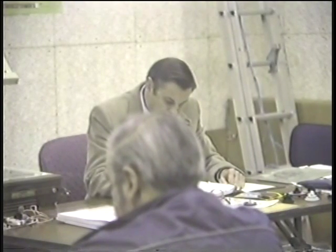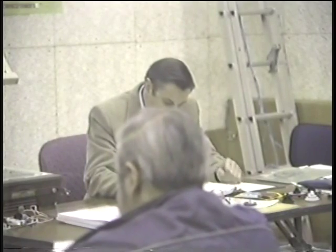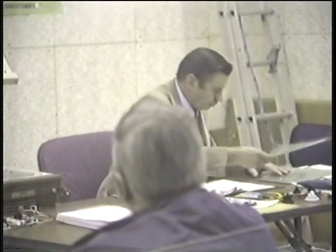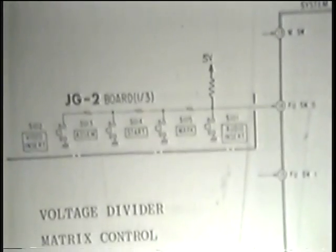Control of the edits is handled by IC 401, system control, main system control IC. The interesting thing is on page 27, that diagram. Is that the function buttons. Again, we have a ladder type network, and it varies a DC voltage into pin 14. And FU obviously stands for function switch, in case you're wondering. So we have a very simple system control. It's not as complicated as some of our other control units.